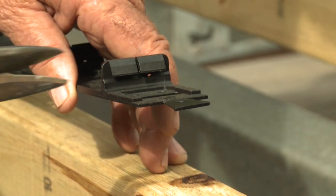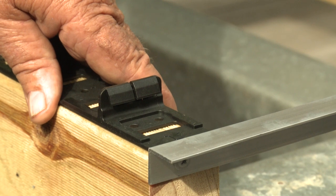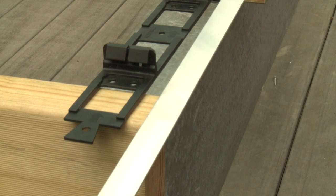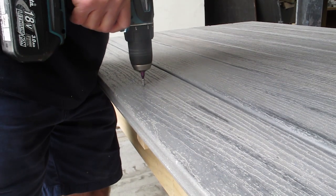For an overhang when using the 88mm clip, you'll need to cut the dovetail off so it's sitting flush to the front of the joist. When using the overhang method for timber joists, use 30x30mm aluminium angle along the length of your deck. Alternatively, you can also screw fix the front board.